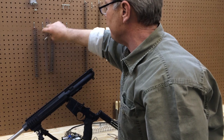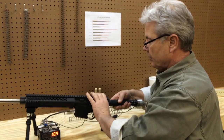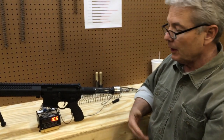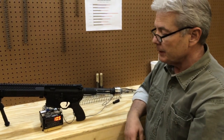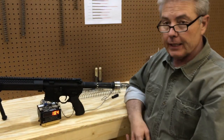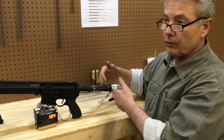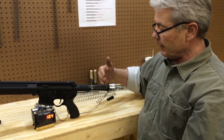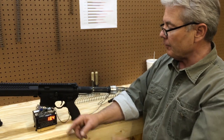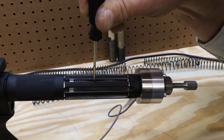That was a standard spring — pretty standard. Here's the same spring with two or three more coils, and consequently it's going to be about 10.6 pounds — roughly the same as our 36-coil flat wire spring at position one. But when we go to position two, it's 18.4 pounds. What that's telling you is I don't want more load at the rear — I want less load. Ideally I'd have 10 or 12 pounds front and rear, but that's in a perfect world. The higher the rear load, you'll notice these coils are closer together because you've got more coils involved.